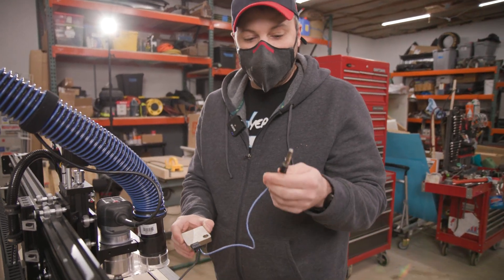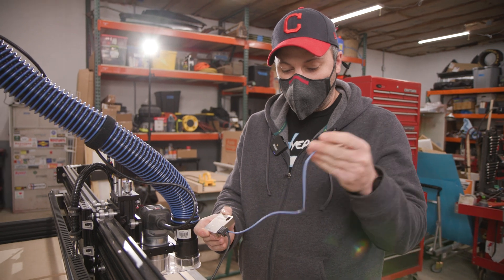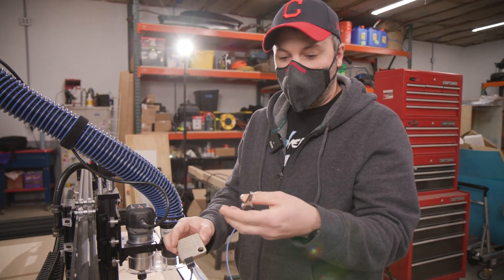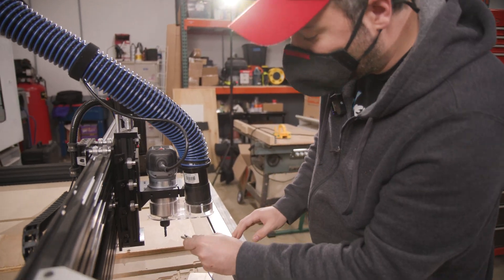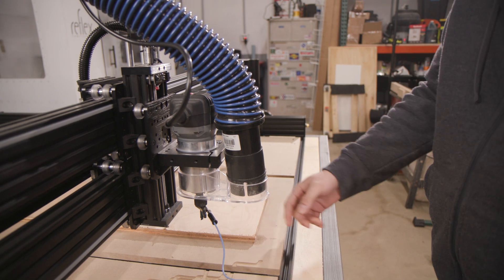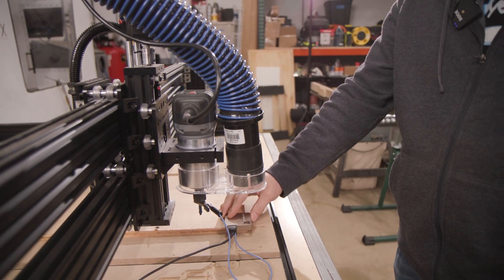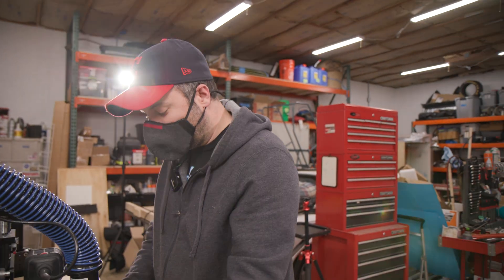Instead I've changed to this — it's a simple alligator clip. I put really high flexibility silicone wire on here; it's much more flexible than the original, which is pretty stiff. This attaches much more securely — it actually mechanically clamps on and it's not going to fall off. You can grab hold of the bit real nice and securely, so when I'm using this I don't have to be afraid of the machine crashing. And I can actually have it find zero. So that's what we're going to do now — find the corner of this part.